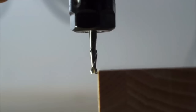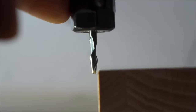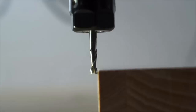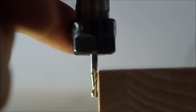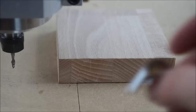You can also do this with the spindle running. At the moment the tool touches the edge of the workpiece perfectly, but if we turn it a little, a gap opens. Whether or not this issue appears depends on flute angle and how deep we go. If we go deep enough to make sure there is always a point along the flute in contact with the workpiece, the issue disappears — but we can also just turn the spindle on to avoid it completely.